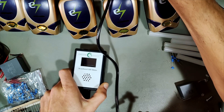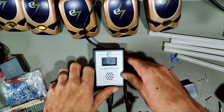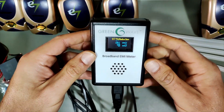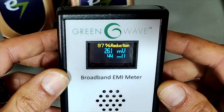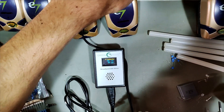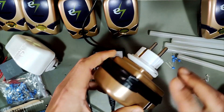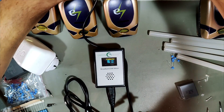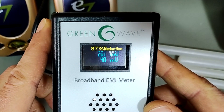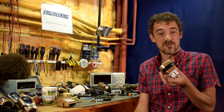When I plug in the GreenWave filter, the noise drops from 261 down to about 40–44. When I plug in our DIY filter, it drops from 261 to just about the same — maybe even slightly better. So there you go, that's how you can DIY your own dirty electricity filters.